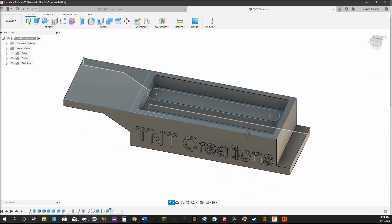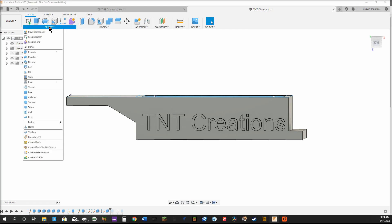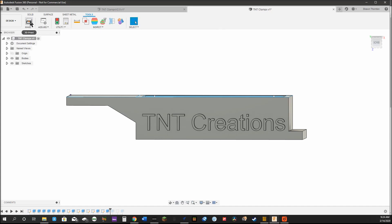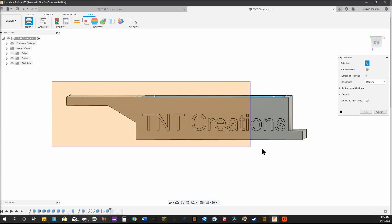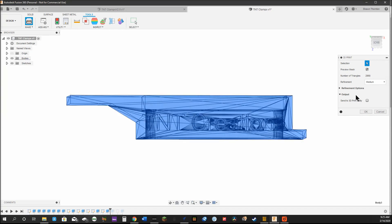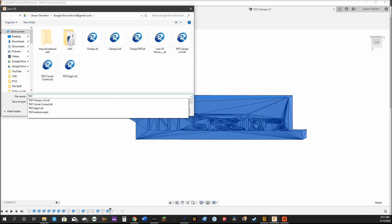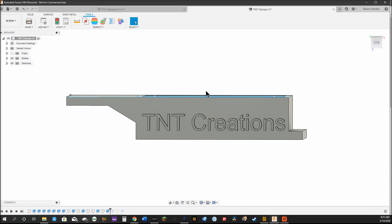Simple update but I think it'll really help. The bracing in the front will keep that flex down, and the little piece on the rear lets us use it as a cam clamp. So we're going to go into our make command, select which body — you can use the body chart on the left or just select it there — and output it to the name you want. In this case this is our updated clamps, so we'll save it as TNT Clamps version 2.1. Both of these are available on our Thingiverse page — free downloads — they're nothing fancy but they really help me.